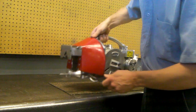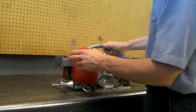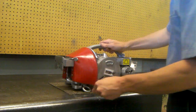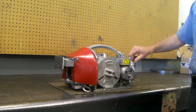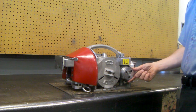To set up, just open the front gate and lock the machine. Open the rear gate and set it up on the strand. Close the strand lock. Engage your lashing wire under the front gate, close it, then route it over the rear gate and close. Make your adjustments.